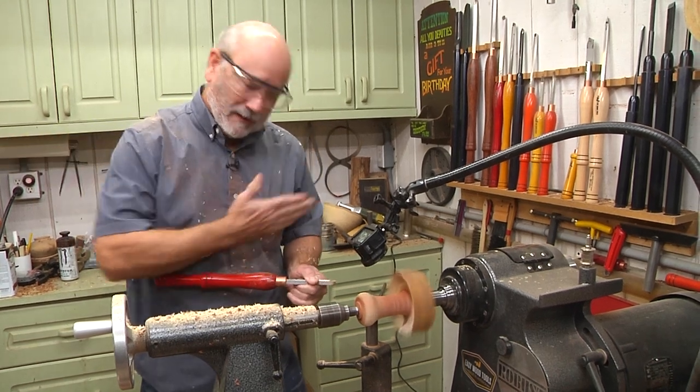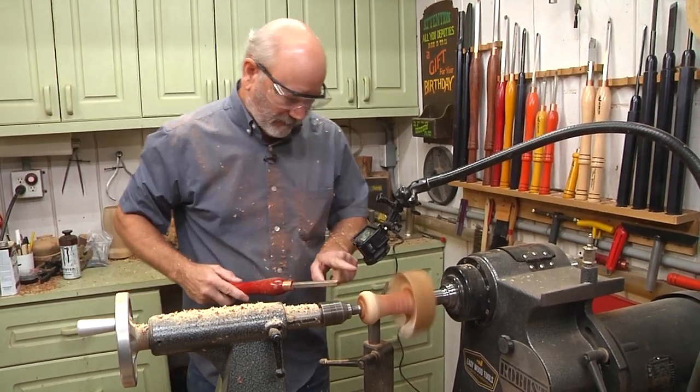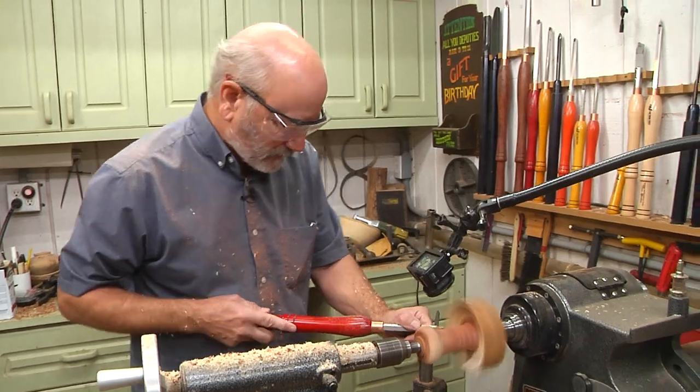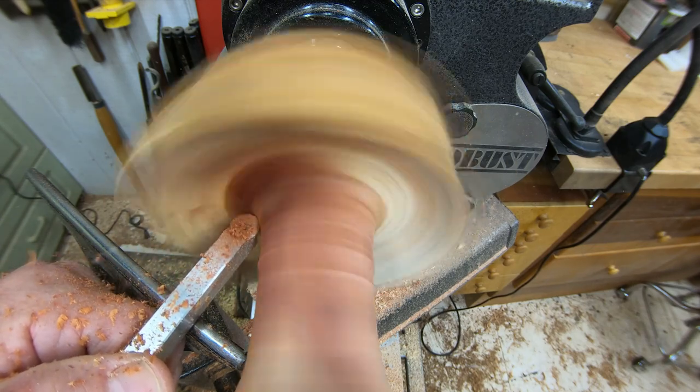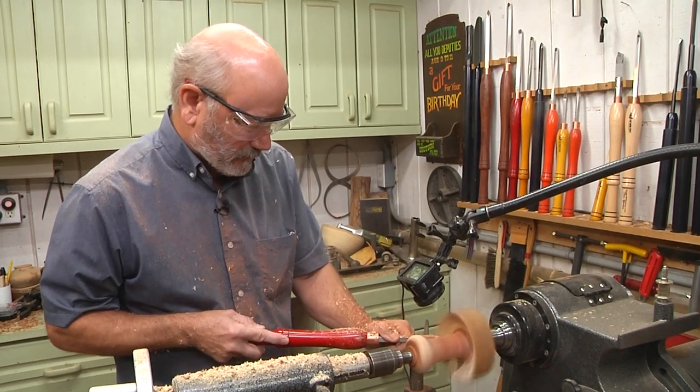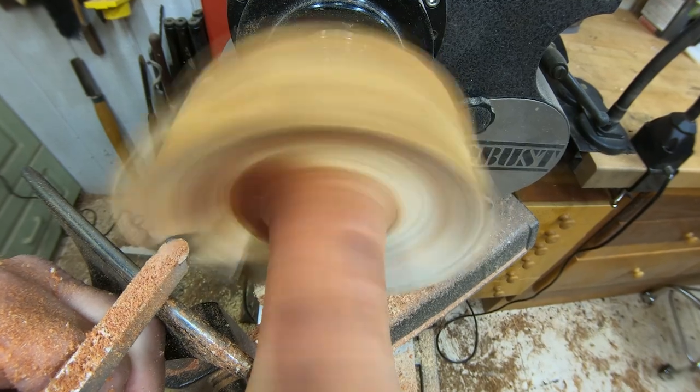We're now at a critical point — making that curve up underneath the mushroom. I've switched to my Robust four-inch tool rest, which is super handy for getting into tight spaces. I've also switched to a negative rake scraper on the Easy Wood, so this is a very gentle cut. When you get into this intersection, this is where you'll get into trouble. Use a spindle gouge or a bowl gouge and you're going to get a catch for sure. If you use the Easy Wood without the negative rake, it'll be a little too aggressive. This allows you to gently go in there and shape this intersection — having the right length tool rest and the right cutter makes life a lot easier.